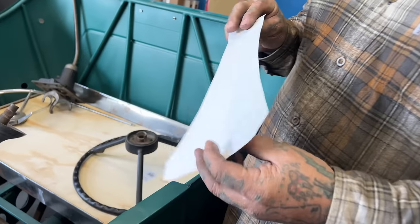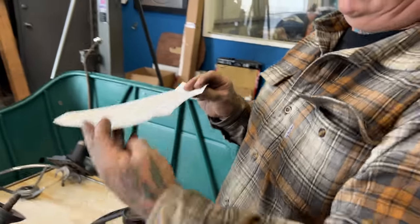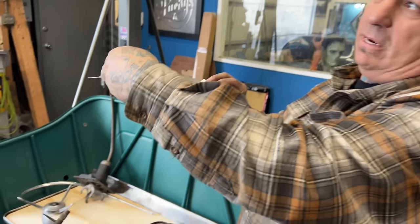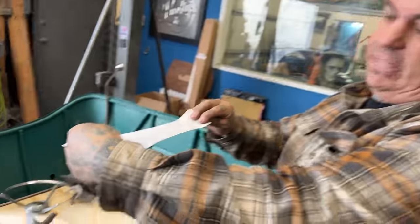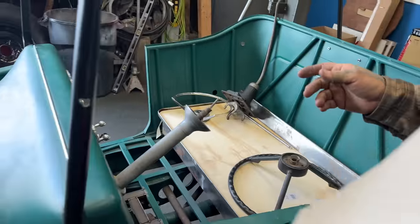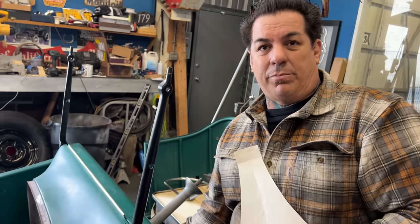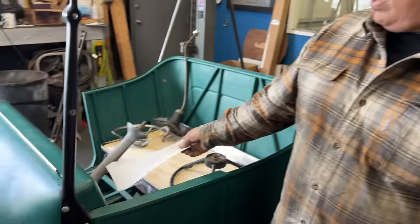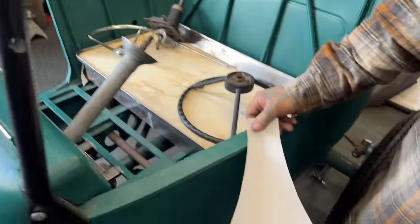So I'm going to build this bracket. I'm going to put it at the top of the steering column under the dash, and I'm going to run it back to the firewall. And it'll bolt on somehow. We have to figure that out. But it's a strength bracket because you and I both know that this dash will pop right up. So if you're slamming on the brakes and you're pushing your steering wheel up, all of that can still move. So I want to put this structure in there so it can move less. Move less is better.